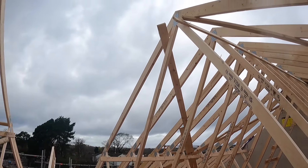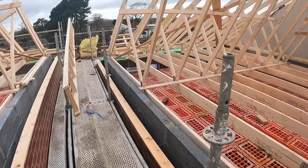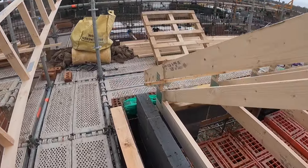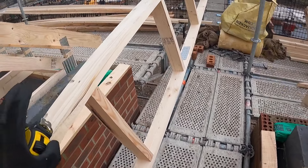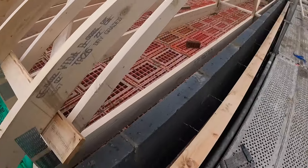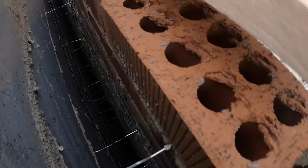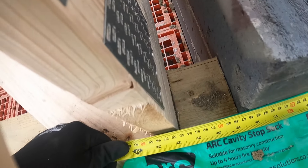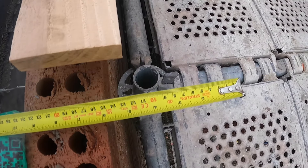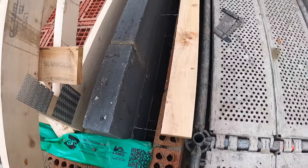In this video we're going to talk about how we set up ladder ends. The first job is setting this truss up for the size of your ladder end. We know the ladder end is 555 and the soffit we're using is 150. So what you've got to do first is hold your tape on the wall at 150 and then set that first truss up to 555. So you know your soffit size and the size of your ladder end, and that sets up that first truss.